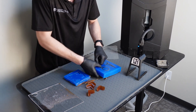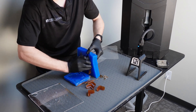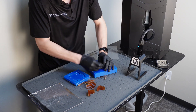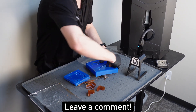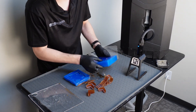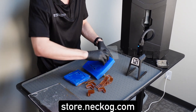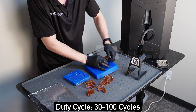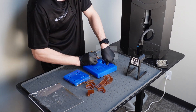Those tools are nice to have on hand and useful for one of our new features we recently implemented — I'll show you what I mean after we demold these parts. Our design team is constantly working on customer molds and new features, so if you have any suggestions about what you'd like to see next or parts you want us to try, feel free to leave a comment. The duty cycle for a silicone mold is usually around 100 cycles for simpler parts like these door stops and corner protectors, and about 30 cycles for more complicated parts — each mold will vary.